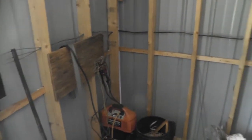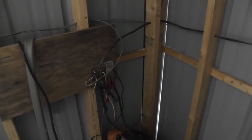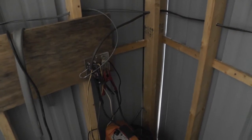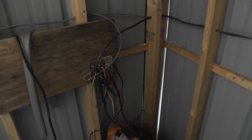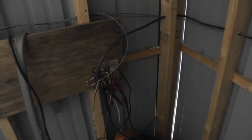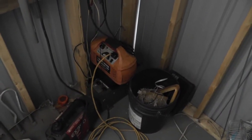Been doing a little work. Got the ceiling in the warm room and got some electrical stuff started. Got a jump box hooked up to it — Aaron was able to use things last night. I made a little terminal point — it's got a 100 amp or 200 amp fuse between the battery and everything else, including the inverter. And I got that battery eliminator charger out of a camper set up. It comes up here to two terminal points which are going to be used — one for each room.